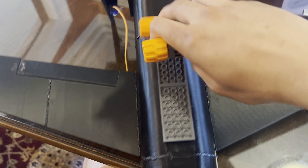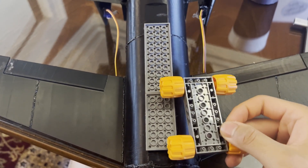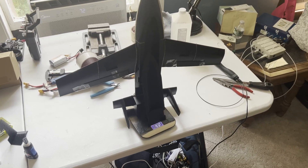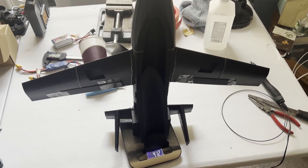For the wheels, I added LEGO wheels which attach to a larger plate. This allows me to move the wheels up and down based on CG adjustments. I also superglued and plastic welded the LEGOs onto the frame. In total, the frame weighed in at 412 grams. While there are definitely ways to cut down on the frame design, I'm pretty happy with this number.